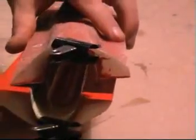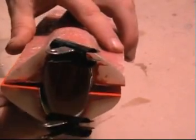You have to tape the cloth hanging down into the centre of the mould and then move across and click into the registration buttons. Here you can see it better. Down and across and click it in. There. You just now need to consolidate the fiberglass into each half.